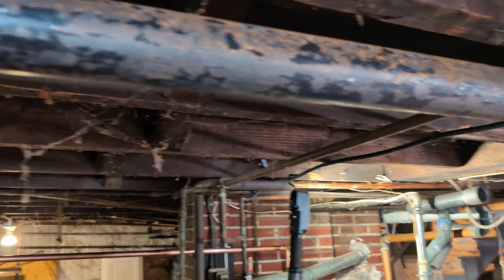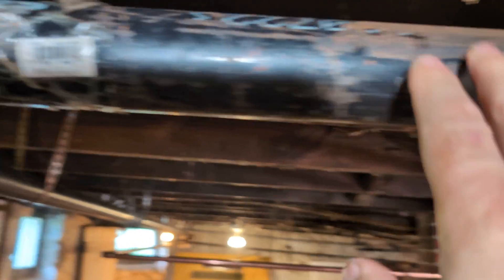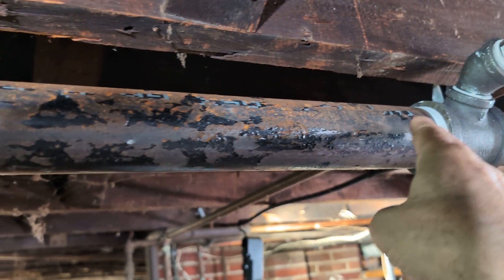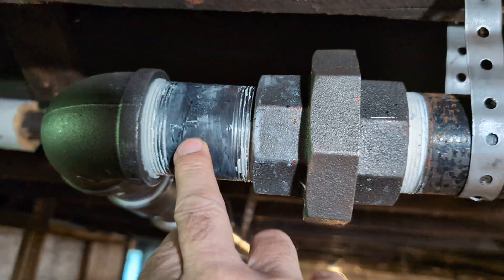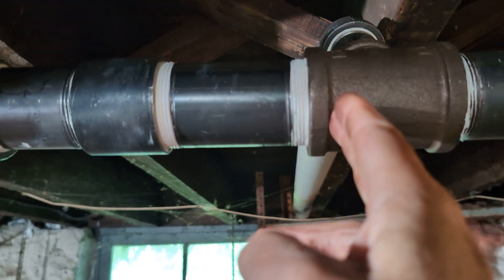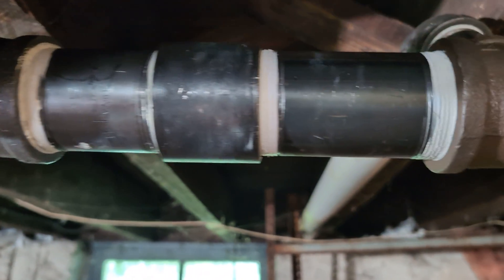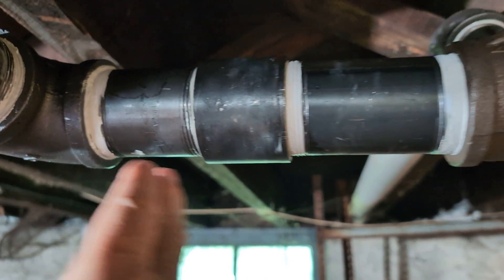We have another piece here, which is actually 2 by 42 inches — a little harder to obtain. This is really nice because this is a fixed point in space that was cast iron. We cracked it off. Now we have a 42-inch piece here, and then a union, and then a nipple, which comes in half-inch increments. So we can essentially dial this in to the length we want to make this turn. We can either cut and thread exactly to length, or make it up using shorter pieces and a steel merchant coupling, which in this size has straight threads, and we can dial this dimension in.